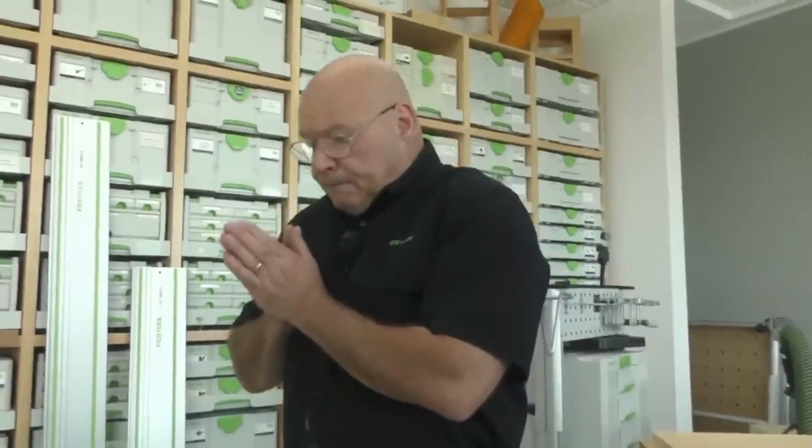I'm going to be ripping in a couple of seconds because I'm going to talk about the 60 now, because that is a huge thing with the depth of cut with a 60. And when I say that, somebody goes, well, TS60, subtract 5. It's not that easy. TS60 sounds good, but if you look in the owner's manual, it's actually a 62 millimeter depth of cut. That is huge, and you'll see why in a few minutes.